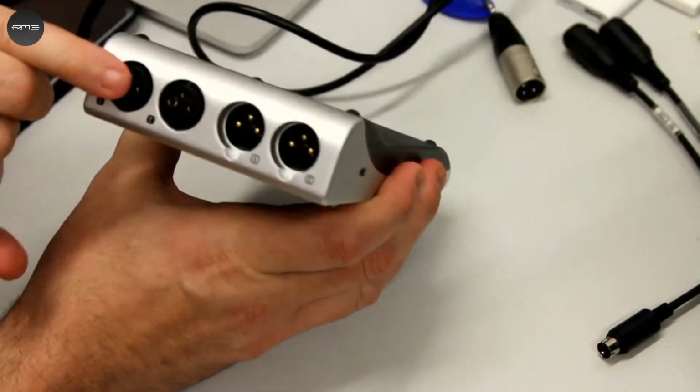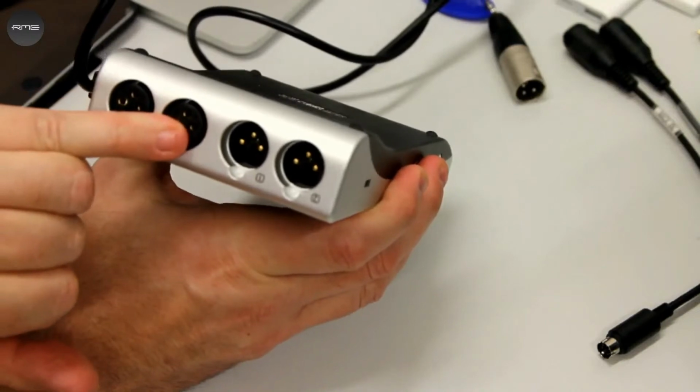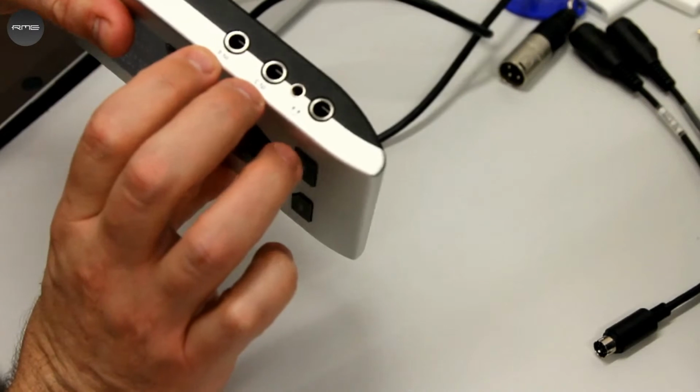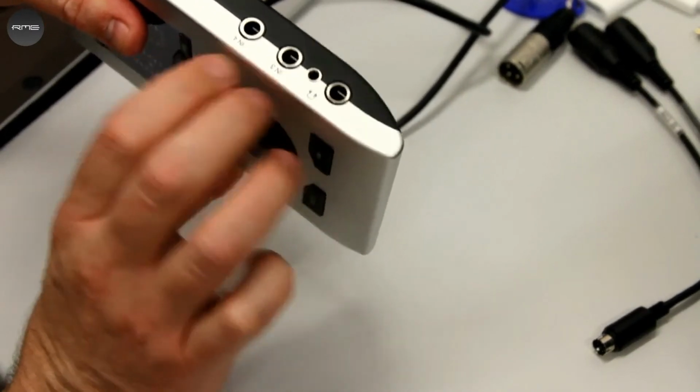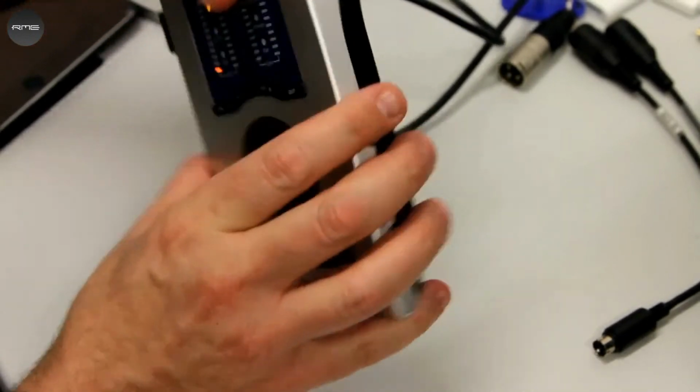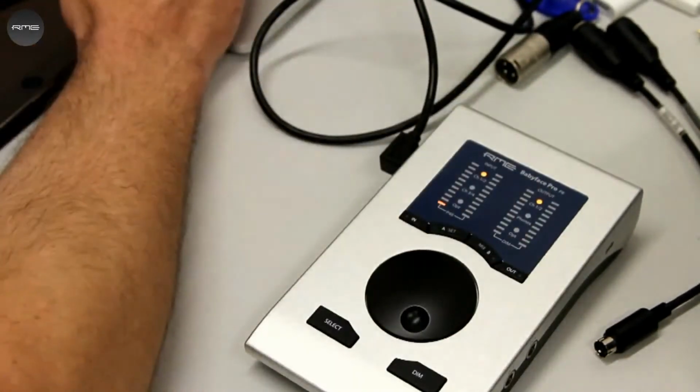Yeah, of course. I assume that you want to record your analog mixing desk to your Babyface. So again, you just connect the USB, and you connect to your analog input. You can use XLR. You have line inputs here. Or if you have unbalanced connections, you can also go into the instrument line inputs.